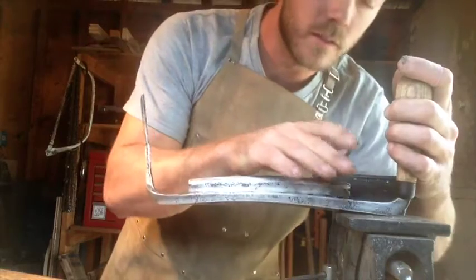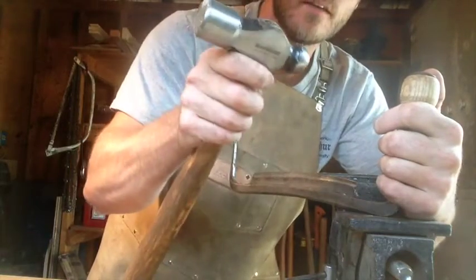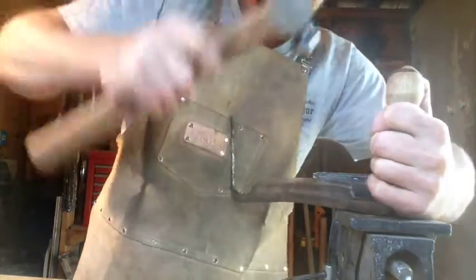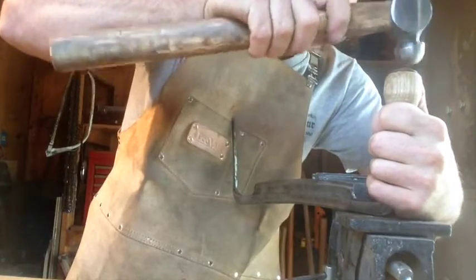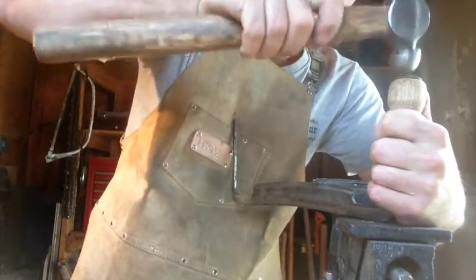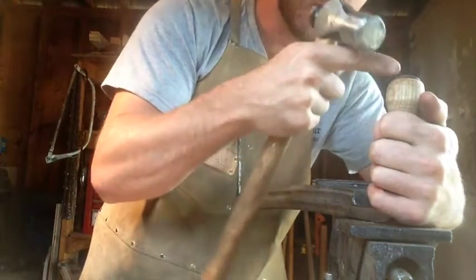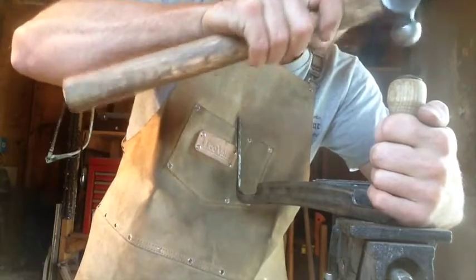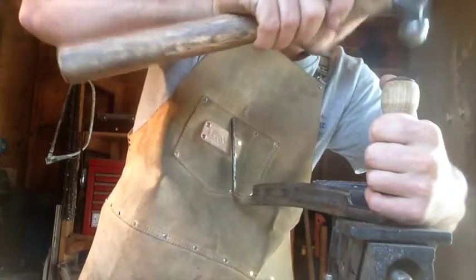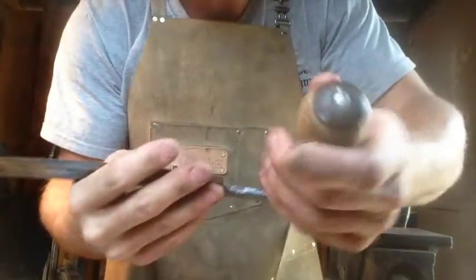So I always rest it on something nice and solid like an anvil or the back of your vise or something. And then with a little protrusion, you want to hit it with the ball peen hammer to peen over the end of your steel. And so you just hold it nice and steady, brace this against myself here, and just gently tap, all kind of around the edges of the pin that's coming up out of the cap here. And once in a while, just make sure this guy's nice and tight down. And it takes some time, but eventually this is nice and tight.